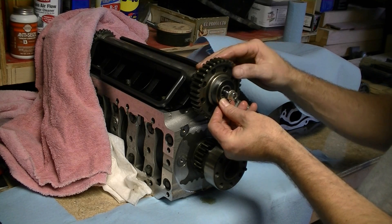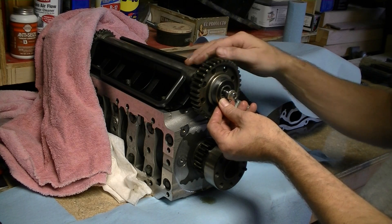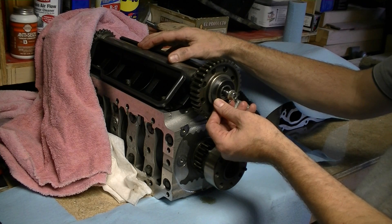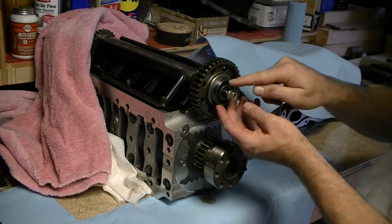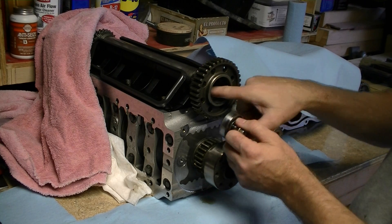When the air comes out this end — and we're probably talking a few cc's, not much air at all — when it comes out this end, you're going to have a lower pressure in the tube once the tube cools compared to the outside pressure. That's going to force oil back through. The oil's got two choices: it can go through the seal, or it can go around it completely and into the tube.